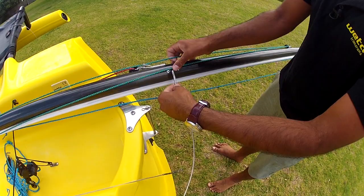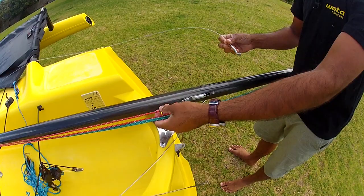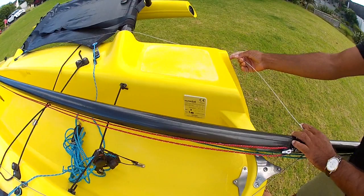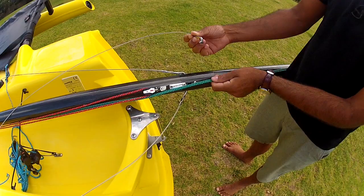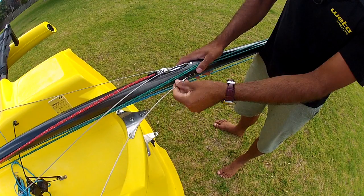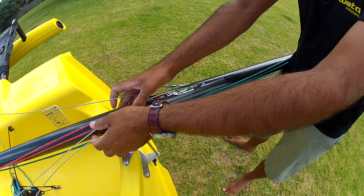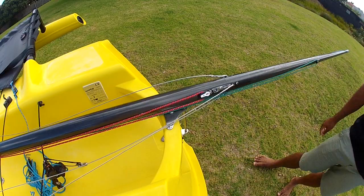The main — just the part that pulls the sail up — is behind the side stays. This one goes here, grab the other one, just roll the mast over, same deal. Make sure the jib and gennaker halyards are in front, and the side stay goes there. You'll see that I just flicked that over the back corner of the boat — that is a common problem I see people catching it on. Then the forestay goes in. Before I walk to put the mast up, make sure all the t-balls are in correctly — they should be tight down like that and nice and straight so there's no risk of them falling loose.